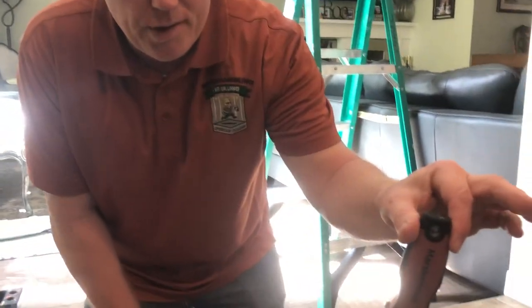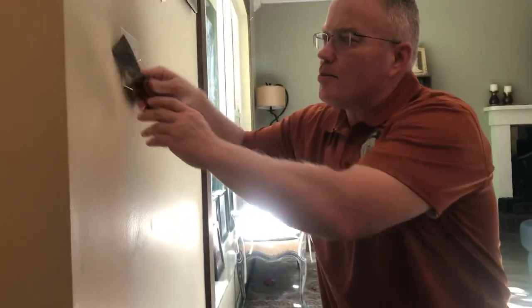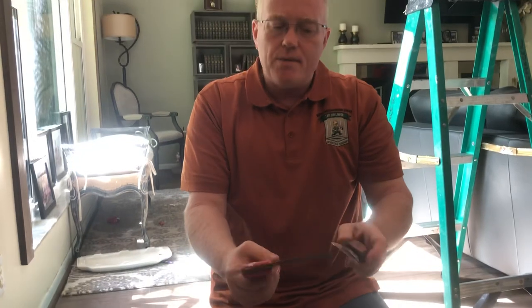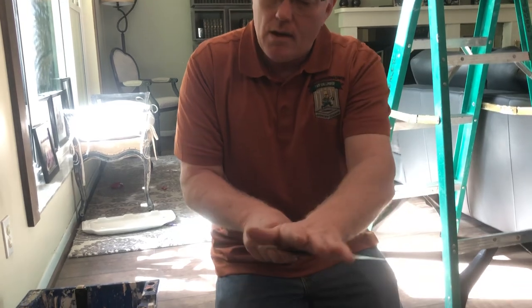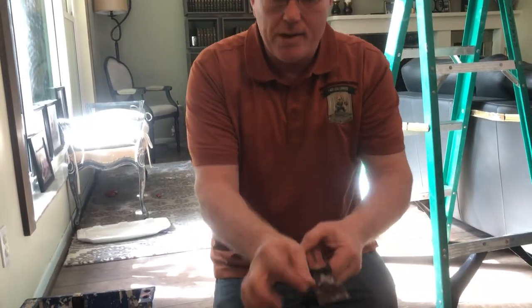Here's a very important, versatile tool. You can get into areas that are very tight, especially around molding — hold your wallpaper down, fill in little gaps, put plaster on with your hand. If your tools get rusty or grimy, take your palm sander or orbital sander, turn them over during downtime on the job, and sand these tools off — just a minute on each side. You'll sharpen them doing that, and it's a great way to get all the dirt off.